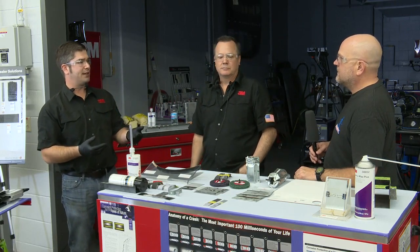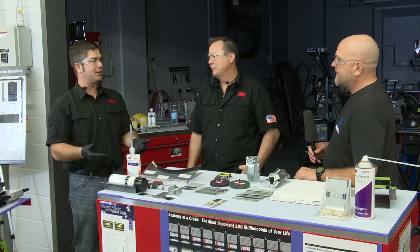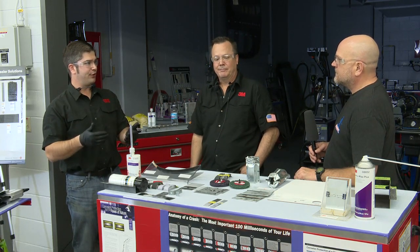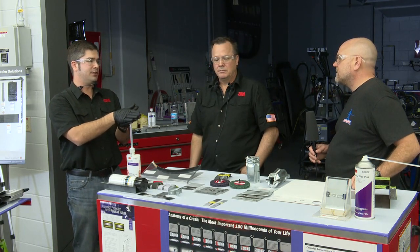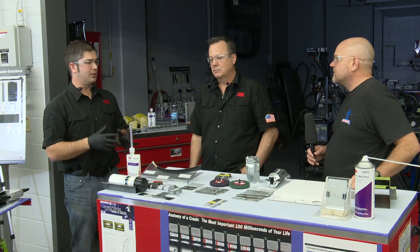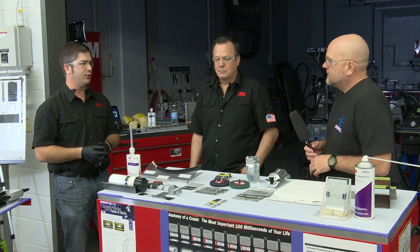So go back to, if we're putting a seam sealer direct to metal and we don't have an epoxy primer or epoxy sealer on our mixing bank, the next step is that metal has to get covered. So they're using an acid etch primer that goes down first and then a urethane on top. Well, when that acid etch primer comes in contact with the urethane, the chemistries don't work. And to Sean's point, it's not specific to 3M. It's just a general rule that needs to be followed.